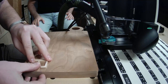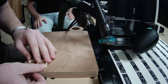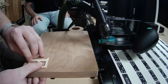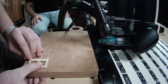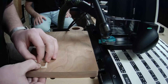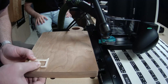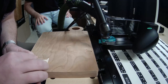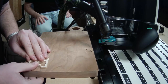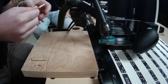That is what we want to see — it's starting to fall in already. Maybe a tap with a hammer, but the hammer is risky business tonight. It looks like there might be a little bit of warp — if it already had that crack in it, that wood must have been moving on us. Let's give it just another two thou, because it's going to fill in with wood glue and the wood glue is going to blend with the maple — it's going to be really perfect.